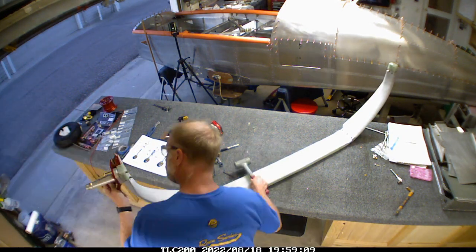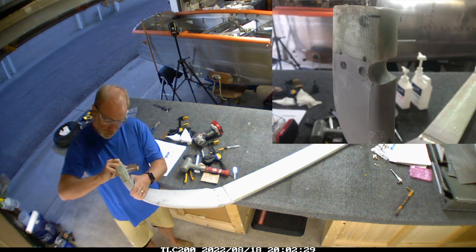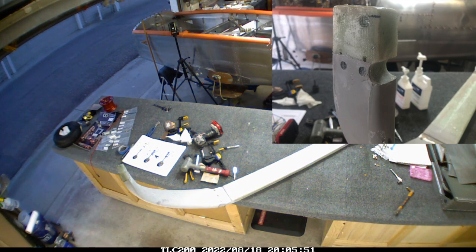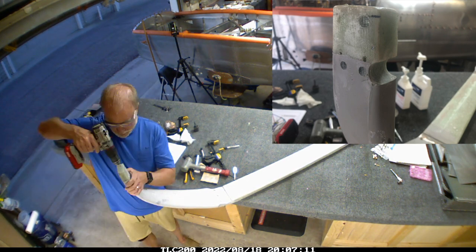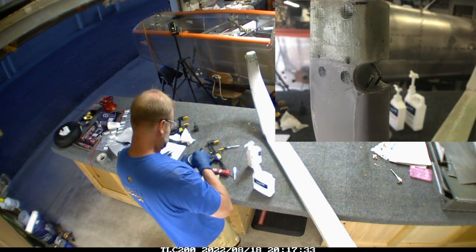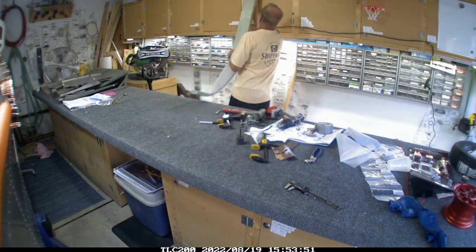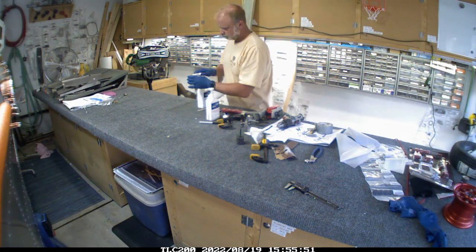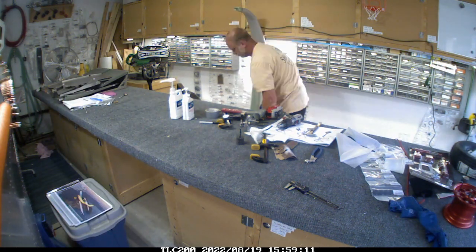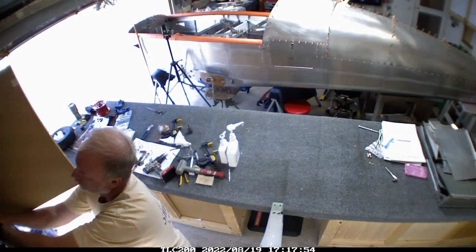What I'm working on here is just trying to get the last of the landing gear together. What I'm doing is backfilling that hole to strengthen it — I popped a couple of stainless steel rivets in there to give a little more surface area for the epoxy backfill. I basically created a little cup and then put epoxy in there so it rounds off that opening. Looks actually pretty good at this point.